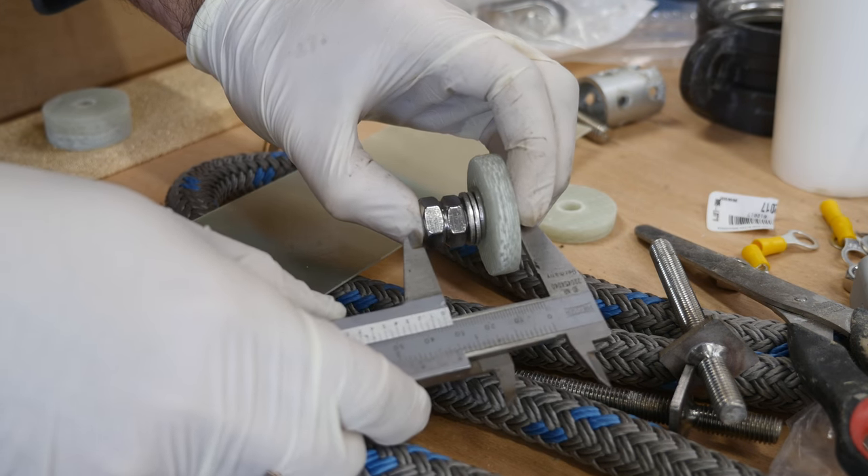In a joyous surprise the halyard deflector I mentioned showed up earlier than expected. There is not a lot to this guy — he is just a plastic wheel of sorts. It opens up so that you can fit it even with the halyard in place, which is kind of a nice feature. With this plastic deflector in place I think I better upgrade my running rigging. Most of the running rigging here aboard Athena is the traditional kind where you have a combination of a polyester line and a steel wire spliced together. I'm pretty sure the steel wire would slice through that plastic halyard deflector in no time. A much more modern solution would be to use a line with a core of something like Dyneema — something that doesn't stretch very much.